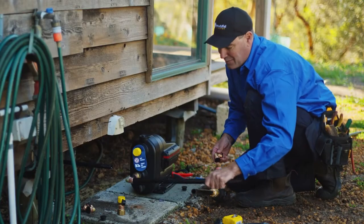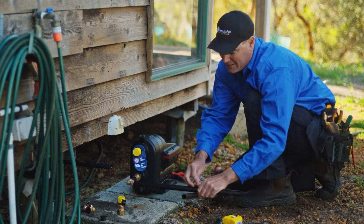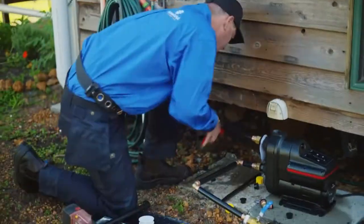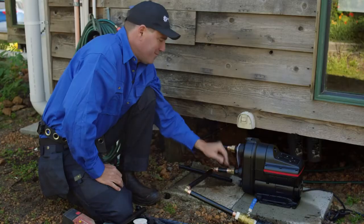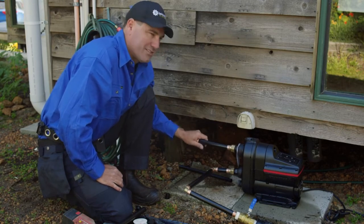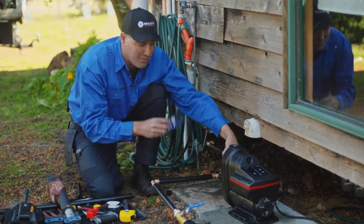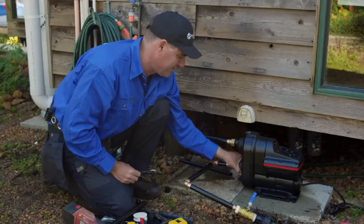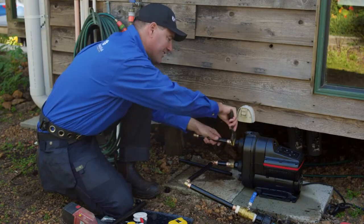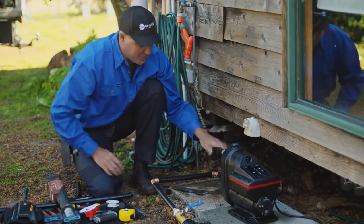This is where the articulation comes in really handy on the inlet and outlets. See how I can adjust the angles, get it all right — it's very easy to adjust and lock in place. We've got the rainwater connected to the inlet. The outlet goes off to the house and there's a filter underneath there. These adjustable connections are just unreal. Remember, there's a tag on there that says no tools — just tighten them up by hand. That's referring to the adjustable nuts. Just snug those up, then snug up the big loose nut connections to get that O-ring nice and tight.